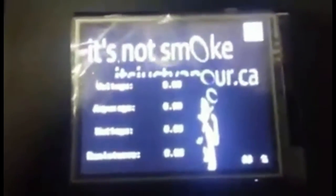Quick update on the BMF — it's now in this new box with a LiPo battery, which helps with the discharge rate a little bit. 414 watts — 414 watts with a loaded voltage of 11.77 volts across the 0.3 ohm coil. Not practical, but it does it.